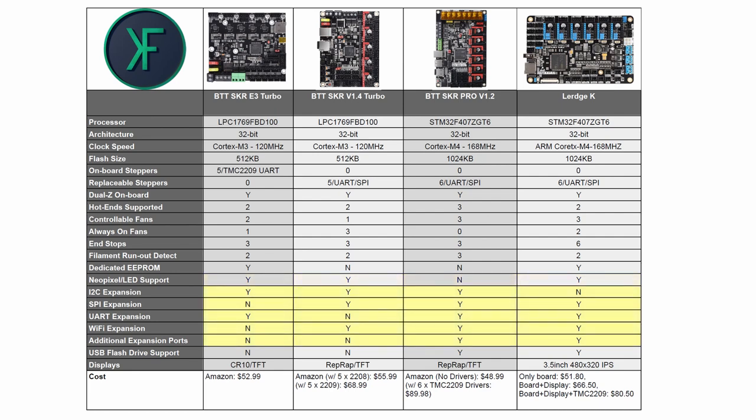We do not have I2C expansion on this board, which isn't really a big deal. Most people are not going to use that feature, but we do have SPI expansion, UART expansion, and this one does have the optional Wi-Fi add-on module. It does have some additional expansion ports that you can find more about by checking the website for this board, which of course will be linked in the description. This one does have USB flash drive support, much like the SKR Pro V1.2, something that the 2 smaller boards, the E3 Turbo and the V1.4 Turbo, do not have.